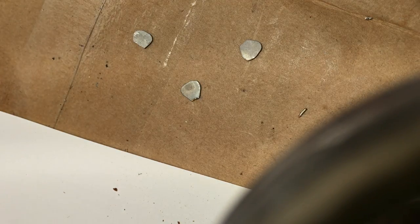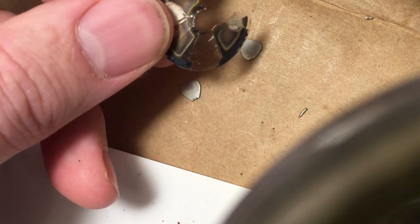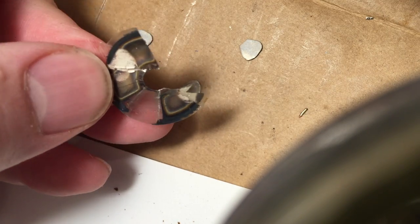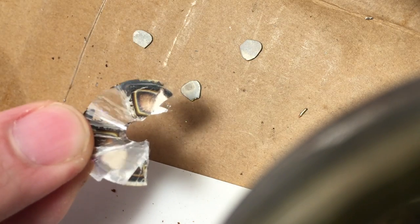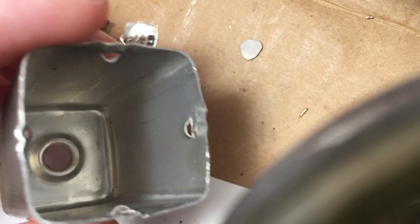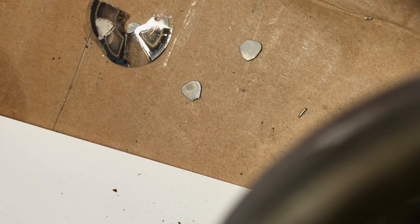We'll put this can back together. Here are the little bits I clipped off — there are actually four of them, I don't know where the fourth went, probably shot across the room. This is some of the mica material, and looks like there was some marking going on in there — that's the silver mica disease. I am certainly no expert on this, but I believe it eventually shorts, and that's what makes all that static and horrible sound. Here's the can in case you're wondering how these came apart.